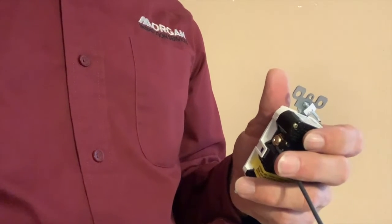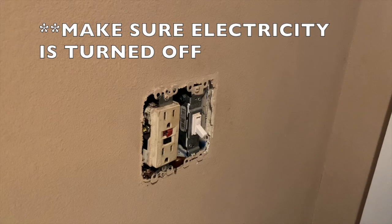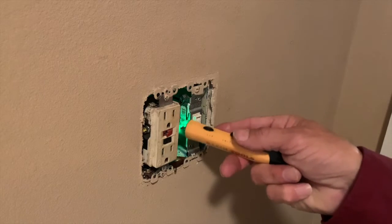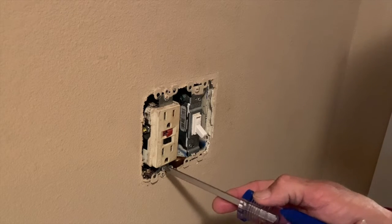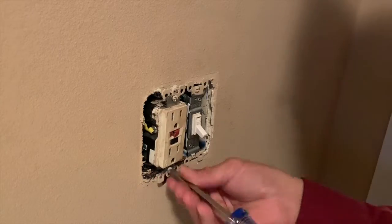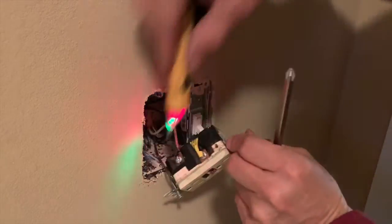Let's go look at how to install this in a house. This GFCI receptacle is about 20 years old. It will no longer reset, so it's not working and I need to replace it. Before you do any kind of electrical work in your home, always make sure the electricity is turned off. I've already turned off the breaker and I'm going to verify it with my voltage sniffer — some people call it that, I call it a chirper. It's not detecting any voltage, so I think we're safe. I'm going to pull this thing out of the wall and double-check there's no voltage on it. There's not.